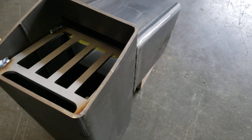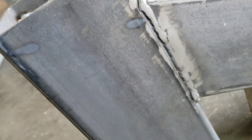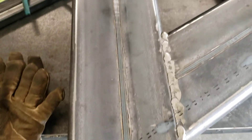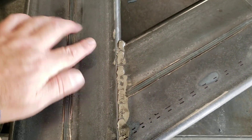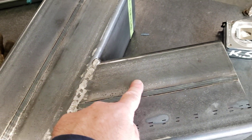I'm going to flip this over so you can get a view of the underside, and that's what the underside should look like. Now is a good time to take your flap wheel and go around the outside of everything to smooth it out. These welds right here aren't going to be the prettiest simply because you're welding a straight cut to a radius — your bottom weld will look better, your top weld will look better — but you want to dress up anywhere where there's welding slag.